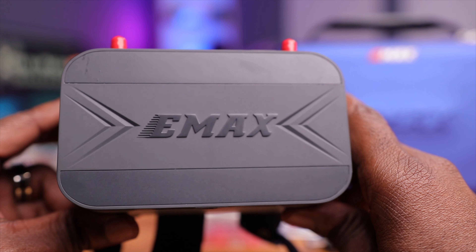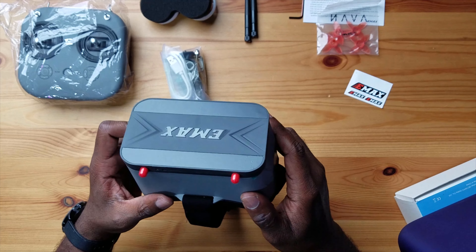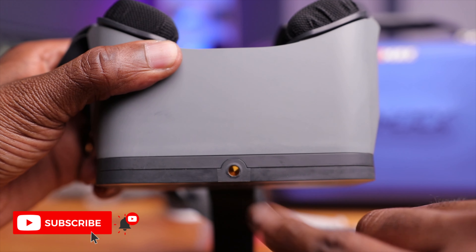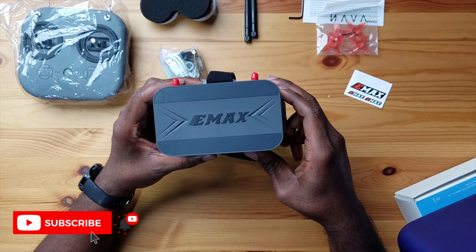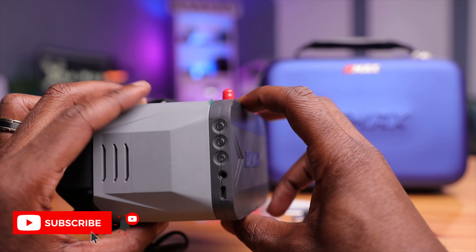I like the color — very nice neutral colors, very representative of most of the colors in FPV. You have two antennas here, and most likely this is a diversity receiver since there are two antennas. On the side, you have a few buttons — it looks like A for automatic search, your power and mode button. There's a slot here for your SD card, so this thing does have a built-in DVR so you can actually record your flights. If you lose your drone, you can replay your flight and see exactly where it landed or crashed. You also have your band, channel, and record button, and a video out port.